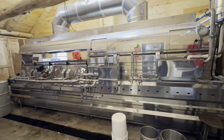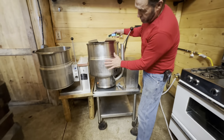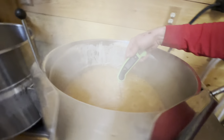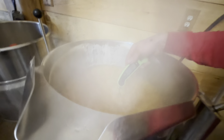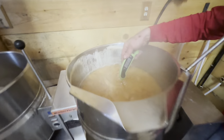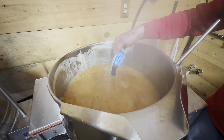This is his evaporator room — he's impressed with the evaporator and I'm impressed with the beam work. This is where he boils his sap in the spring. This is the steam kettle — there's a little bit of water in here, and the heating element heats the syrup. We can see the temperature is at 220, going to 230, and we want to be at 238. It's kind of like a double boiler — that's exactly what it is. We're at 235 now and it might be a little higher.